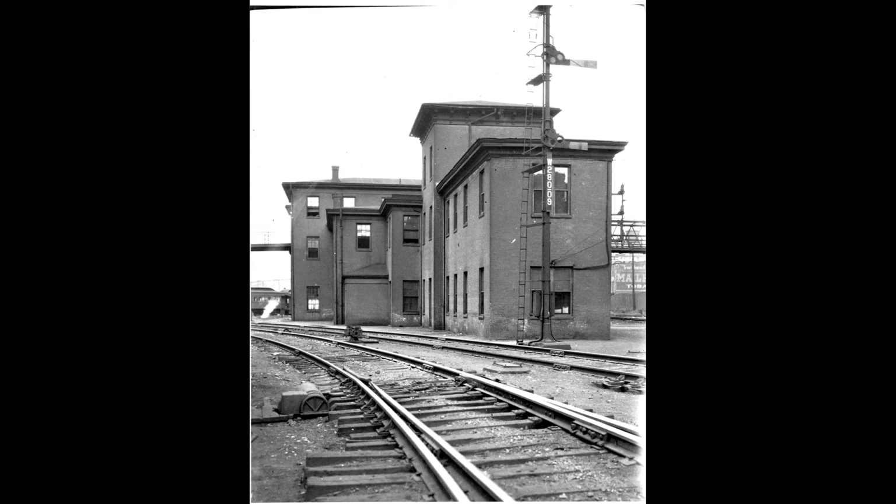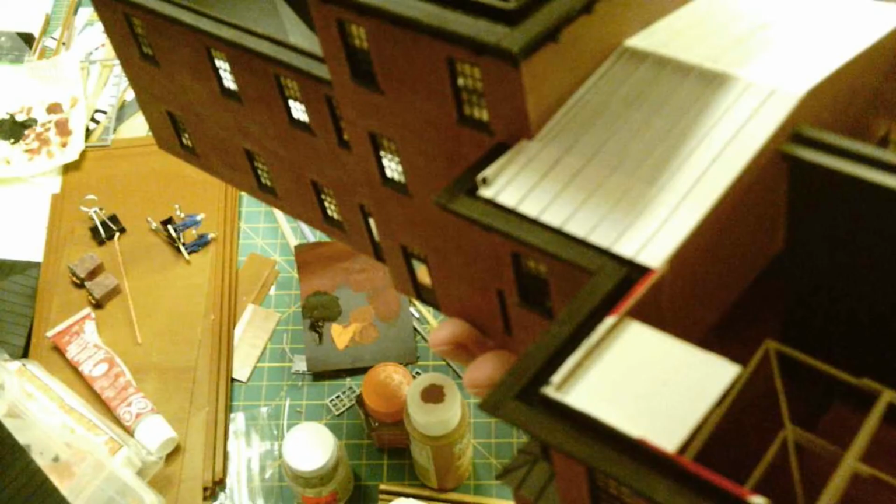Now the next chore that I had on my list was to get the roofing on this third building back now that the buildings are all connected and we had the structure in place for the roof. So I just went ahead and did this, and you can see on the ends of that building there are kind of square pieces that stick up to block the runoff from the roof from coming over these short sides. So I'm coming back and adding those short sides on both sides of this and adding the standing seams in them and finishing off the roofs.